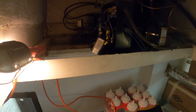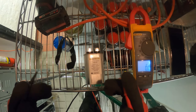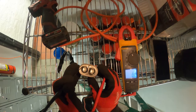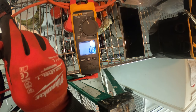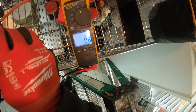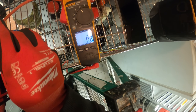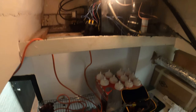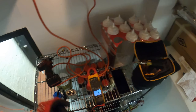Let's go ahead and check the motor run capacitor. Here's the run capacitor — it says 15 microfarads plus or minus 5%. No feedback. These things are completely out — 0.8 microfarads. Both these things are terrible. No wonder this compressor is not starting.